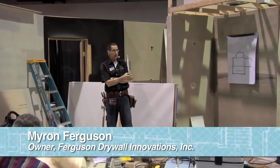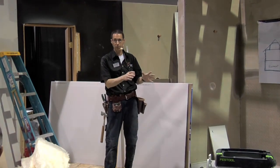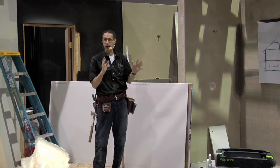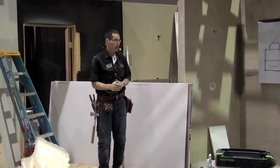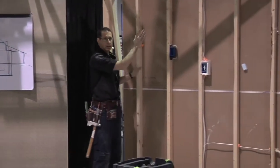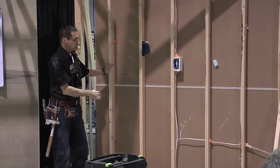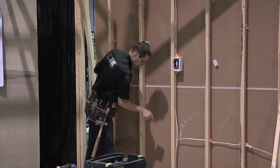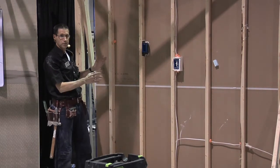This presentation is about airtight drywall and air sealing. We're going to air seal before we attach any drywall, creating a continuous air barrier — the drywall will be part of that barrier. But using drywall alone on this wall as a continuous air barrier is very difficult because we have cutouts and holes leading to the basement and up into the ceiling above.